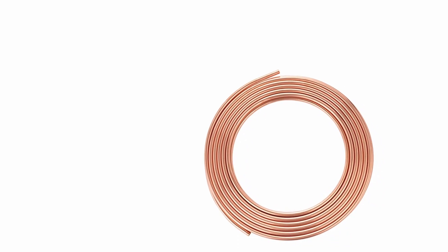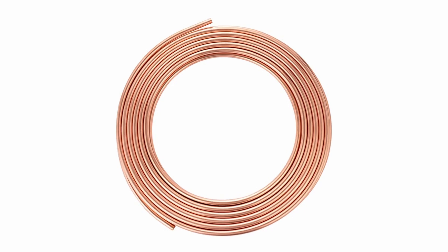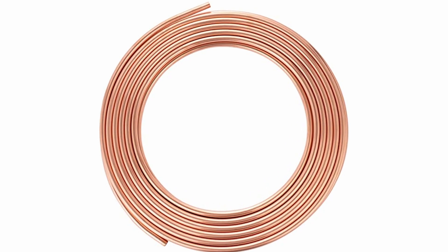So the first thing I would do is get rid of the black rubber hose and replace that with either half-inch or three-eighths inch copper tubing. The rubber hose, although it does pick up the heat, doesn't transfer the heat as well as copper tubing would. So that is on the agenda for this summer.